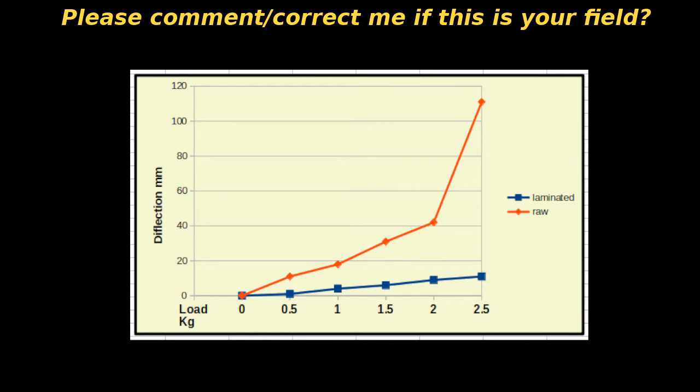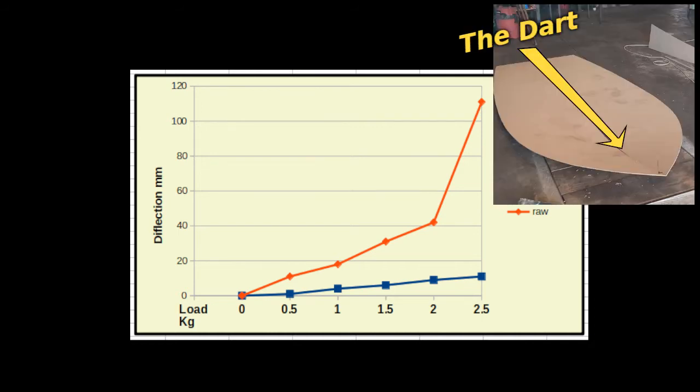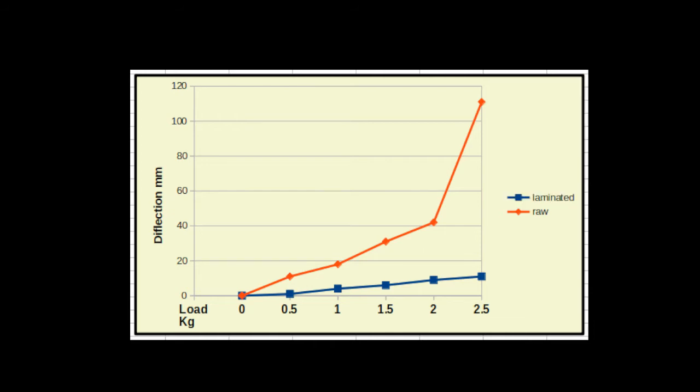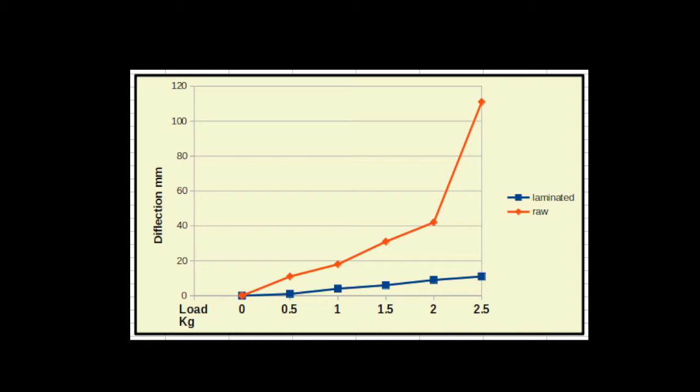The blue line at the bottom was still tracking in a straight line — I was really surprised at just how strong MDF actually is when you apply epoxy and fiberglass to it. One of the really good things about using thin material is that I wanted curves in this boat, and with thicker material I wouldn't get those curves. With three millimeter MDF I could bend it to get the little V in the bow where I put the dart in, and now that I've put fiberglass on it, it's stiff and holds that shape. This was the point where I thought: I think this might just work.